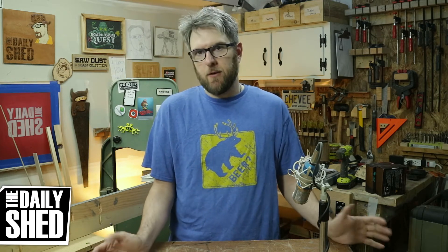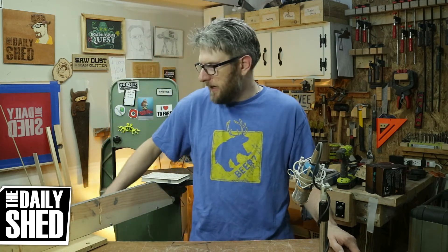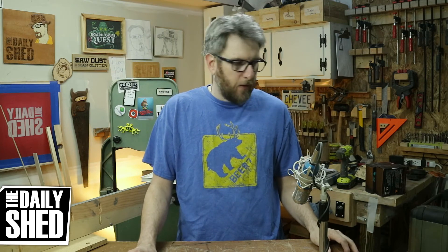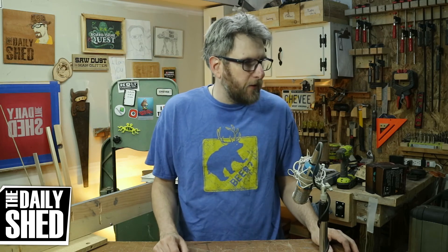The wax is what is actually going to give it that nice touch, that nice feel. This right now feels a little bit like a magazine cover — it's a little weird — and it does have a little bit of roughness from the grain. Buff it with some steel wool and then buff in the wax. I use the steel wool also to buff in the wax. Perfect finish. So maybe someday I'll do a video about that — it's not going to be in this video, but now you know.